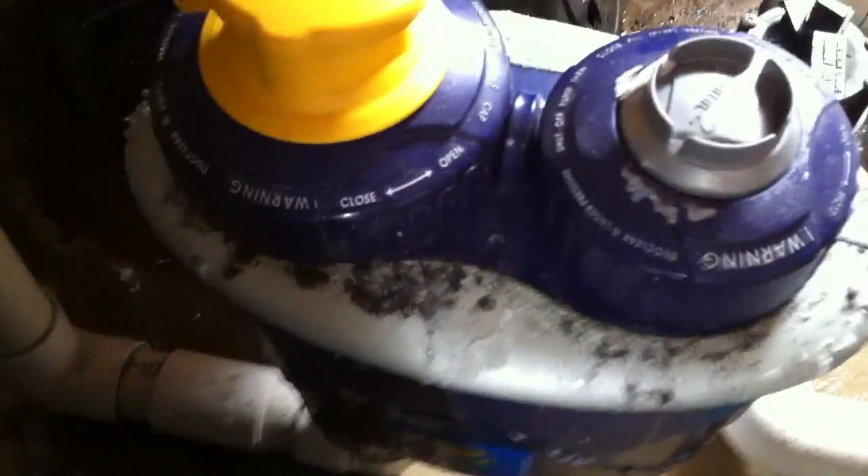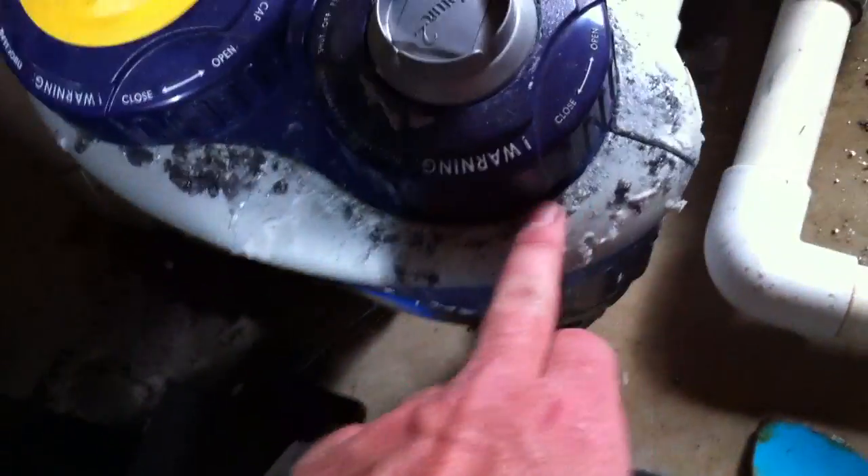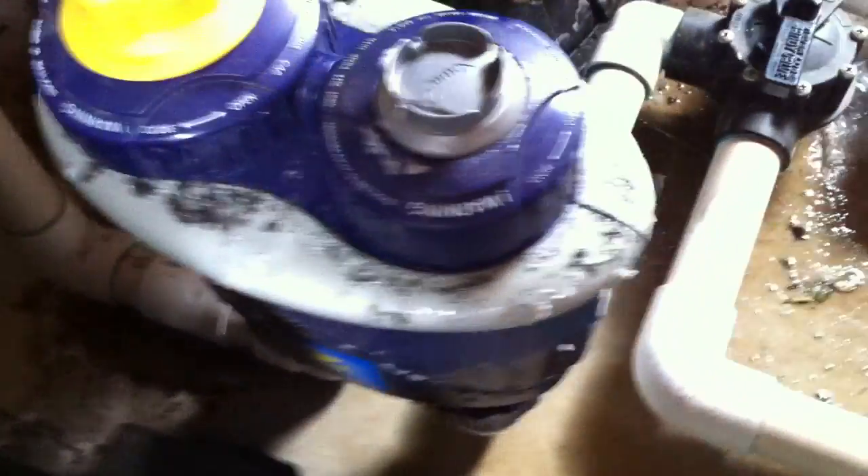So we come back down into the heater, back out of the heater here, and then we go down into this combo unit — the Zodiac clear water system. There's a pretty big leak from it. The floor is wet and it all seems to be coming from right here, so definitely a leak in that system that should be fixed. You can see pretty extensive staining on there — probably been like that for a while. I do not like that there's no check valve in between that salt chlorinator and this heater, because the heater is not protected against that chlorine.